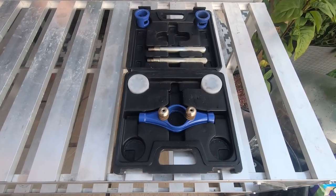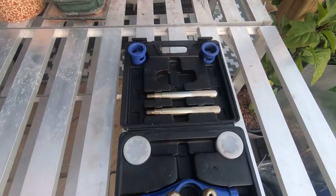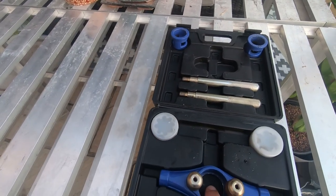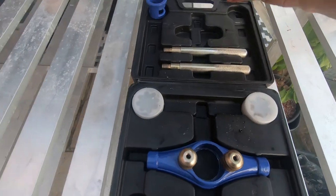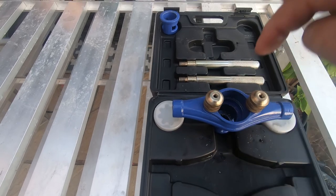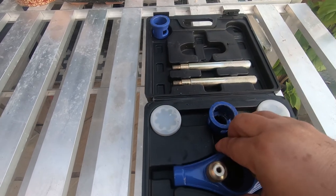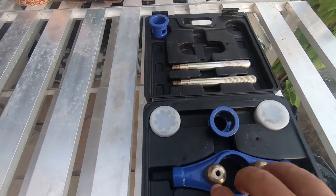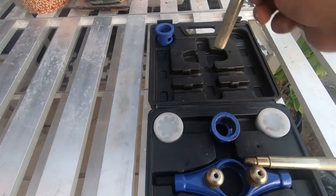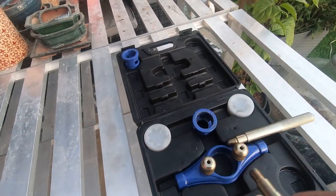So this is the tool we were using for cutting the thread into the conduit, the stock and die. Basically that die fits into that stock, and the lead stock goes into there first, so that slots into there, and then the 20mm cutting die is in there, on top of there, and then it's all clamped down, and then you have the arms of the unit put together like that, and it's a twist and turn threading.